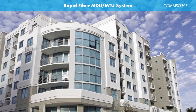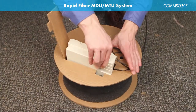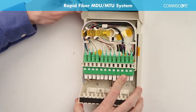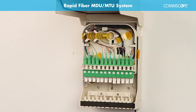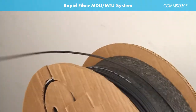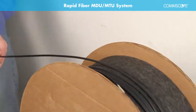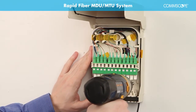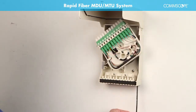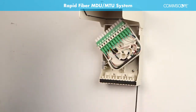For smaller building types, the Mini Rapid Fiber Distribution Terminal, or Mini RDT, can be used in place of the IFDT. The compact Mini RDT can serve up to 12 living units per floor or building. Equipped with the Rapid Reel Fiber Cable Spool, the Mini RDT can quickly deploy the desired length of plenum or indoor-outdoor cable and make the connection to the FDH. Once mounted on the wall, the last several feet of cable can be paid out from the unit's internal cable spool, and any unused cable slack easily stores back on the cable spool for permanent storage.